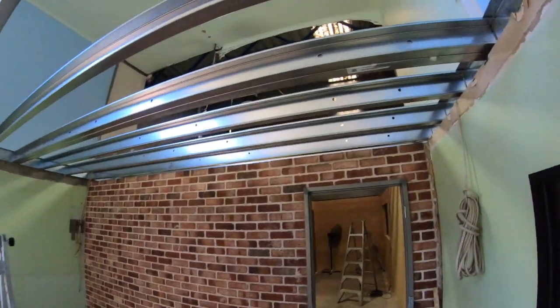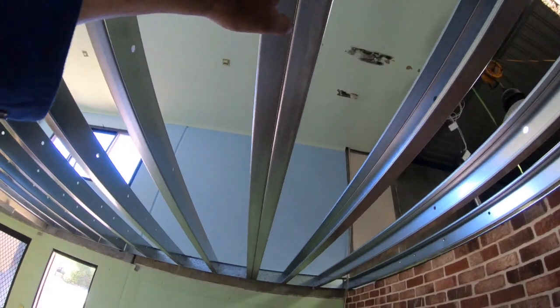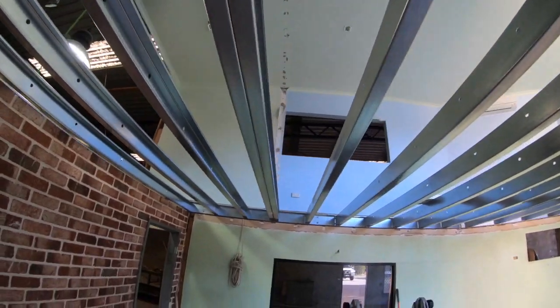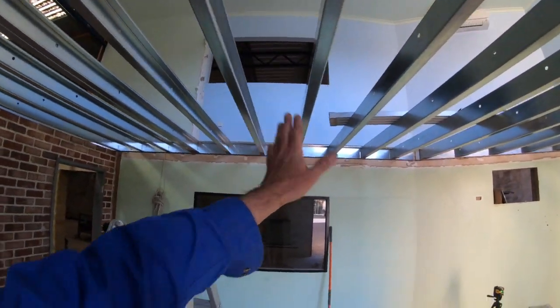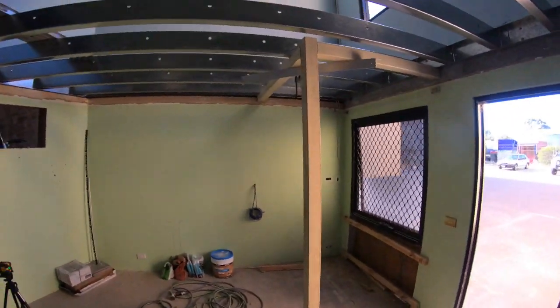As you can see here, this is the double beam that you have to put in when there's a wall. I'm going above it because above this beam there's going to be a wall — it's not going to really take any weight — but that's what the engineer said I had to do. I've sort of over-engineered all this; he said it was fine to go to 600 centres but I've gone 450, and it's a lot less bouncy, which is good.